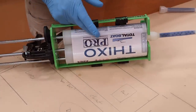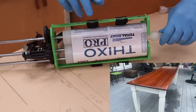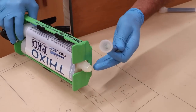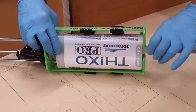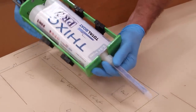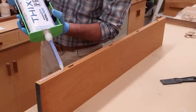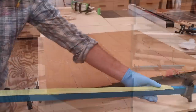For outdoor table tops I really like TotalBoat's Thixo Epoxy — it's proven itself on a few projects, the table out by the grill and the table down on the Jersey Shore. I just took the old tip off; as you can see it's hardened at the tip but still soft and unmixed at the end. I'll put a new tip back on and it's good to go — you don't have to worry if you don't use the whole tube, it really comes down to just changing the tip. Put down a two or three inch bead before you start to make sure it's totally mixed in the mixing tip. I'll apply the epoxy to both boards, make sure it's evenly spread, and put painter's tape on the bottom clamps to prevent the epoxy from sticking to them.